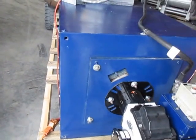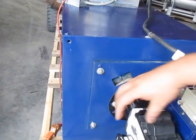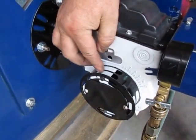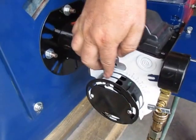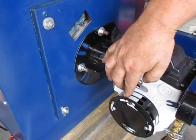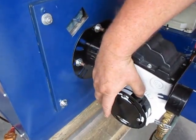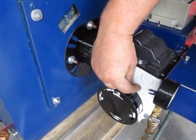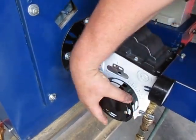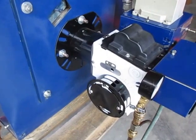Pay attention closely when you first open your peep door — sometimes you introduce extra false air that takes the black tail away. The combustion air here blows air at the fire. The coarse air band adjusts the air — typically we put a green line to show about where to adjust it. Then the fine air band has a long finger that rotates and adjusts the air. Both coarse and fine together set the combustion air.